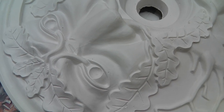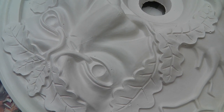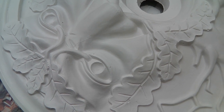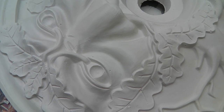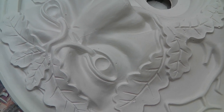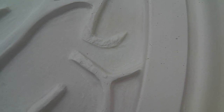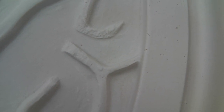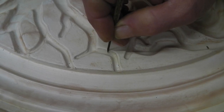First cast came out — learnt a few things from that one. Make sure you've got plenty of space on your memory card when you're filming. Main point: it needs demoulding before it starts the crystallisation phase of setting, where the plaster expands slightly. It was a bit of a chore to get it out but it's come out fine. There are a couple of little areas where it didn't release and snapped bits off, so I can just modify the mould, reseal it, and go for another one.